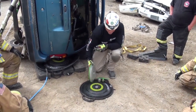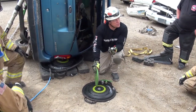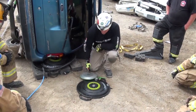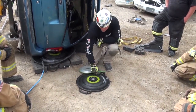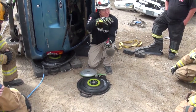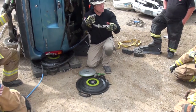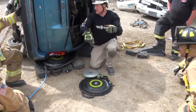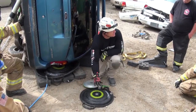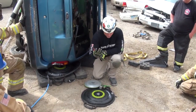One of the most unique things about these bags is as they lift, you do not decrease significantly in your lifting capacity because you've got all of this area of surface contact that's collecting the load. With a pillow bag, as it gets bigger and bigger, your surface contact gets smaller and smaller, which takes your lifting capacity and makes it plummet. These maintain a really large surface contact throughout the lift, so you've got a very consistent lifting capacity throughout.